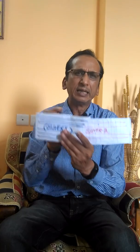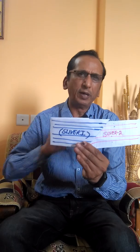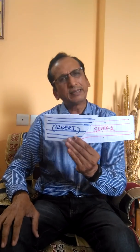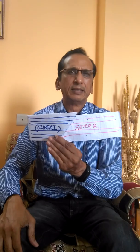So what we normally used to do at the point of joint is give a slight twist so that this material is neither opened nor gets stuck at any further point, and at the same time the drafting of this material at the point of joint is done at the next stage.